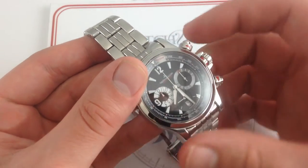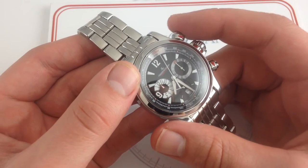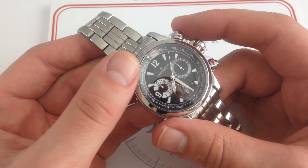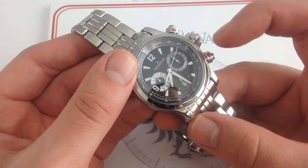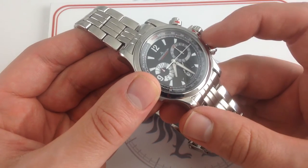I'm going to start it up right here. You can see when you start the chronograph, you have that tactile pleasure of the column wheel — crisp, traditional watchmaking. You can also hear it; it's a nice, robust snap-snap. Crisp watchmaking, high precision. The harder, more expensive way to build a chronograph — a cam-operated system is cheaper and easier to mass manufacture, but JLC wasn't cutting corners.